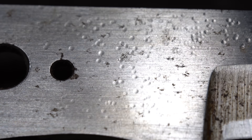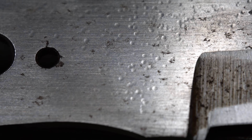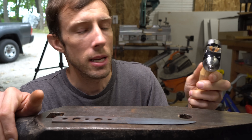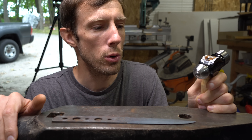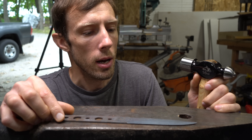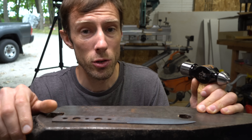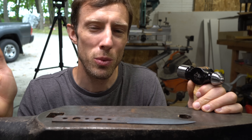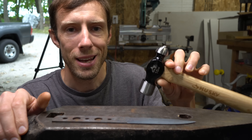So this is what the hammer does to the surface. The idea is to do this process right after quenching, and you can then remove all of the dimples when you finish grinding the bevels and the flats, leaving you with a perfectly straight blade. This is going to straighten just about any hardened steel — this is O1, the other piece is A2. Especially with air hardening steels it can be really difficult to straighten after hardening. I had a piece of CPM M4 recently that warped badly on me — I actually broke it in half trying to straighten it, and this tool would have saved that blade.